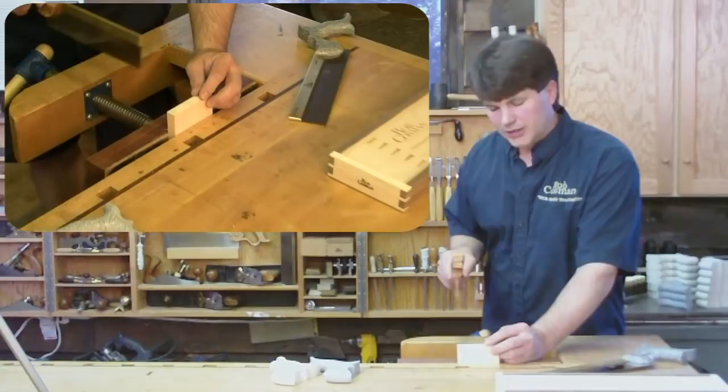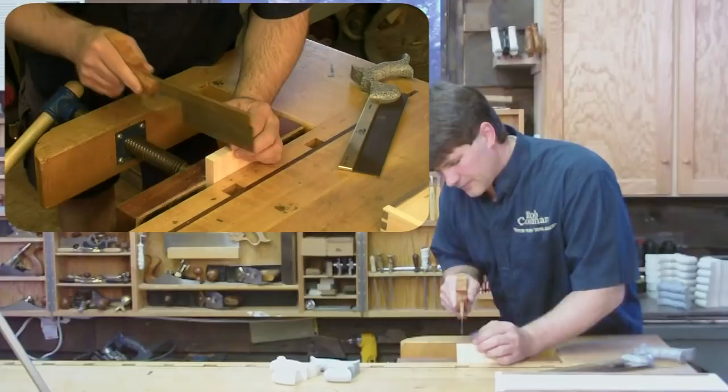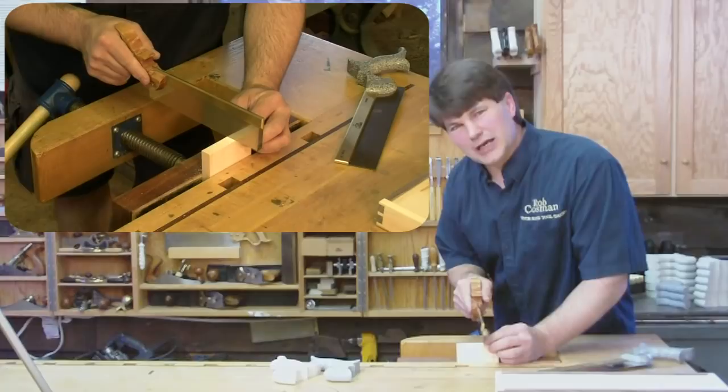What I would have them do is pinch the wood with their index finger and thumb — that creates an anchor point. Now press the saw laterally against the fingertips. Most dovetail saws have fairly coarse teeth, and that's good because you want that speed of cut, but here's what you'd end up hearing. Well, if that's the way you're starting your cut, you're not going to get the precision you're looking for.